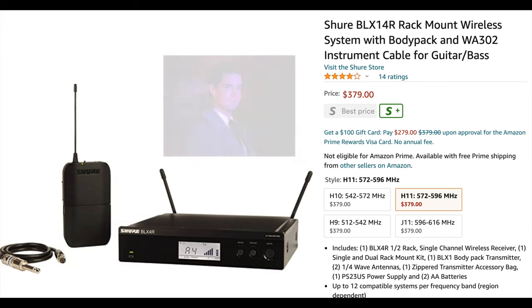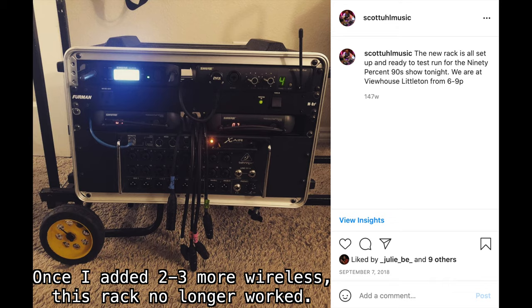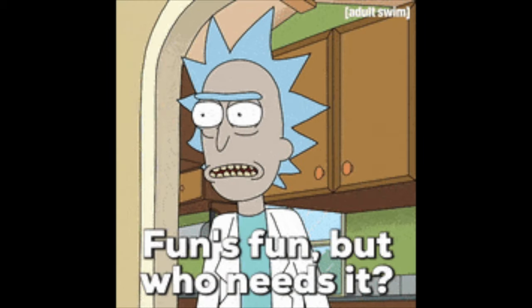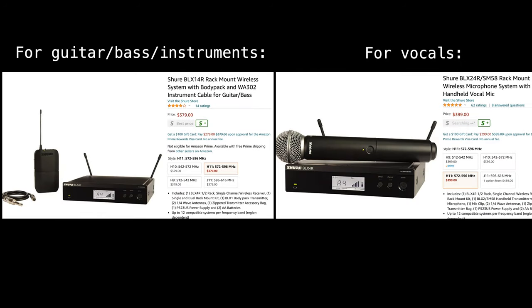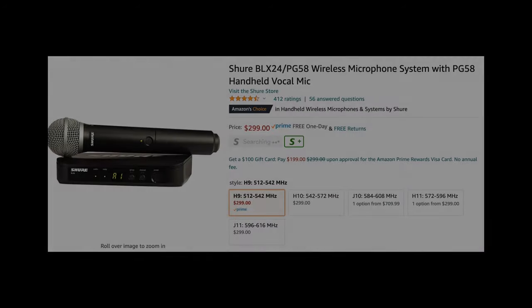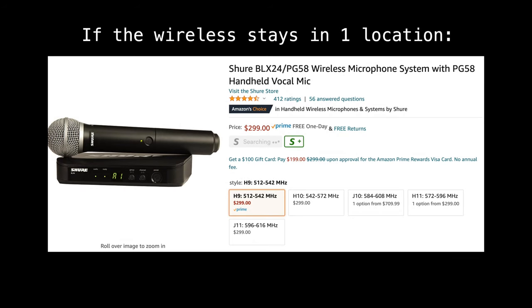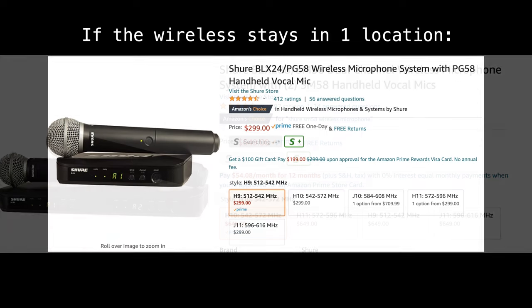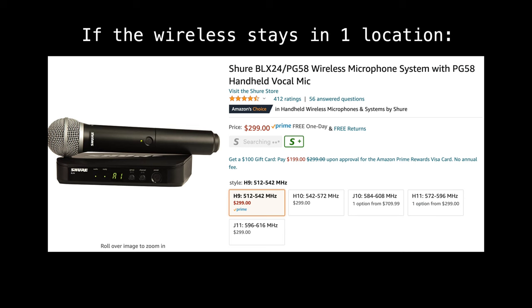Another reason to get the ones with external detachable antennas. In areas with lots of wireless interference it started cutting out — that's when we upgraded. Once you start adding a lot of wireless systems, you'll need to spend more money to handle that. But if you're only using one to maybe five wireless systems, you should be fine. I still recommend the external antenna versions. Also, if you have units racked right next to each other you're more likely to get dropouts than if transmitters are spread across the stage.